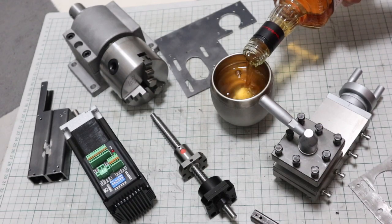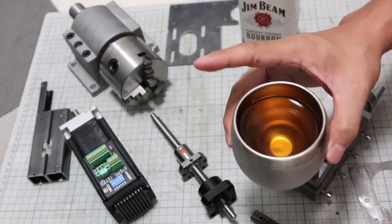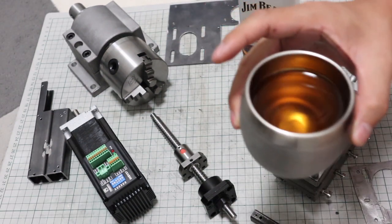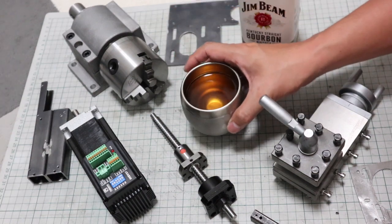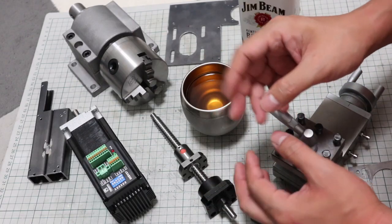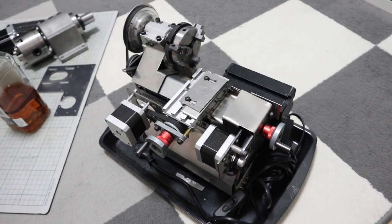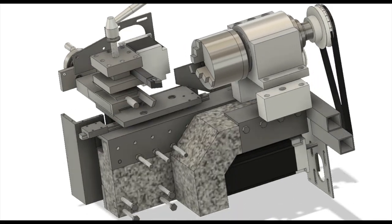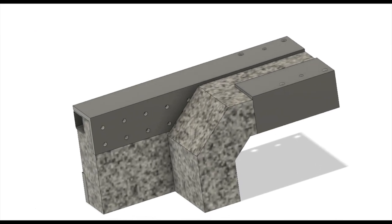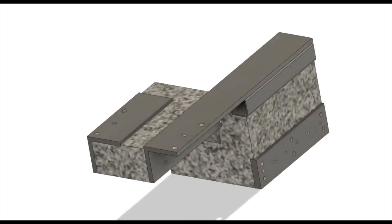However, building a CNC lathe is not easy. Machining metal parts is a challenge because I do not have sufficient machining equipment. For small parts, I have this 5-axis CNC machine and a modified 3-axis CNC machine that I have built before, so I can do metal machining. With this lathe, metal turning is also possible. The problem is creating the machine base. The largest part of the CNC lathe is the machine base. I do not have the equipment to machine a part of this size.